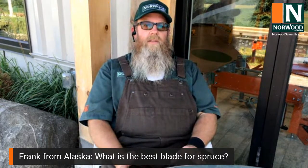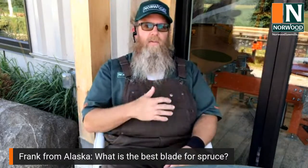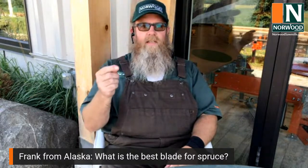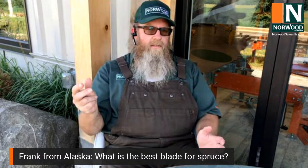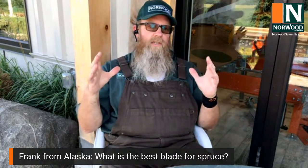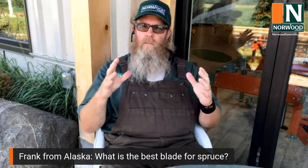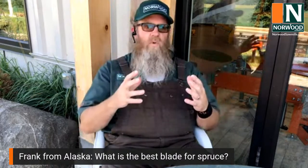So the numbers I'm going to share with you are really general, and this is more what I experience. So I can share that with you because I know that that's a fact. When I put a new blade on, I cut a lot of hemlock. So let's say I'm cutting hemlock all day, 8 to 10 foot lengths, somewhere between 14 and 22 inches in diameter, I can run with a new blade until about 2 o'clock in the afternoon. I know somewhere around 1 or 2 o'clock that blade's going to get tired. It's just kind of my rhythm and how many logs I've moved.